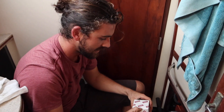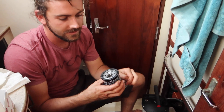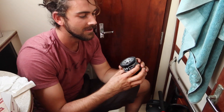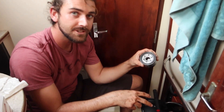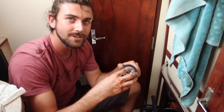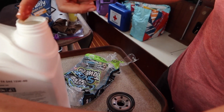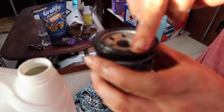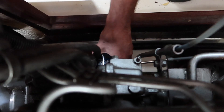One thing you must remember when changing an oil filter: check this rubber ring — sometimes the rubber ring stays on the engine, and when you try to seal it up it creates a gap, and you will have an oil mess. So always check the surface on the engine to make sure there is no old oil ring. Then get a nice finger of oil and lubricate that seal nicely. And remember, it just needs to be hand tight.